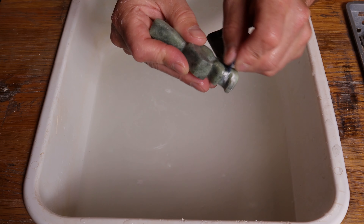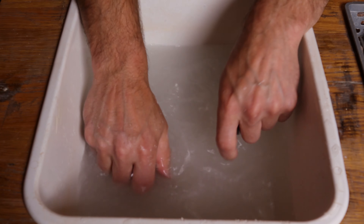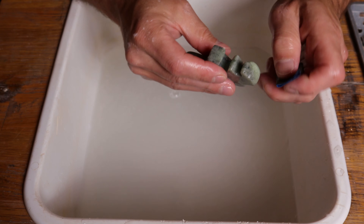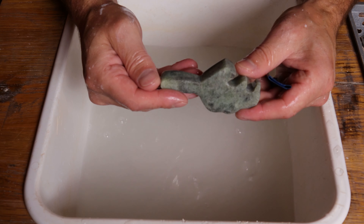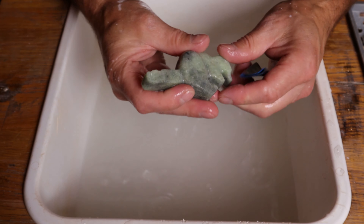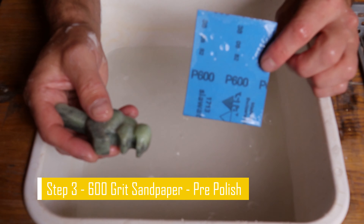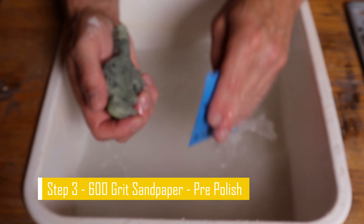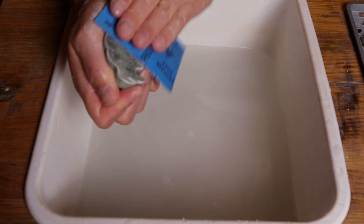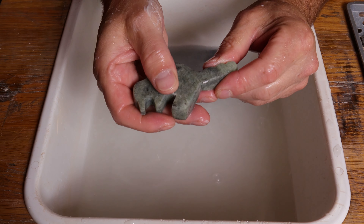It's really close to sandpaper three right now. No big blatant scratches anywhere. Natural colors coming through everywhere, looks really nice — I feel like I am good to go to sandpaper three. Tap that water out, sandpaper three goes in. This is a 600 grit, almost twice as smooth as sandpaper two. Pick an open side, give it 15 to 20 good scrubs, stop, rinse it off — that should feel like glass, really really smooth.